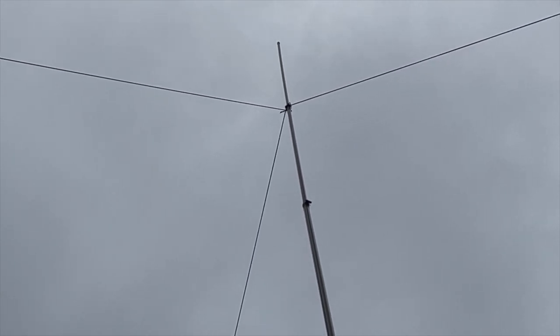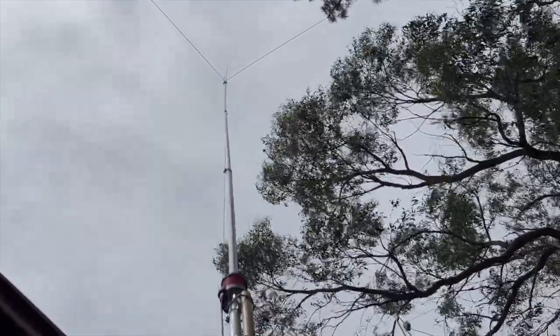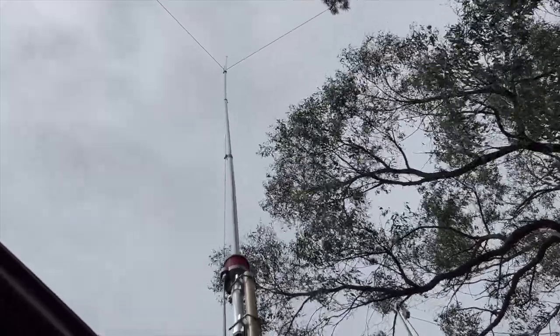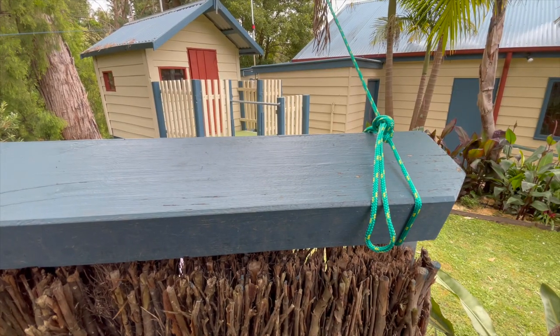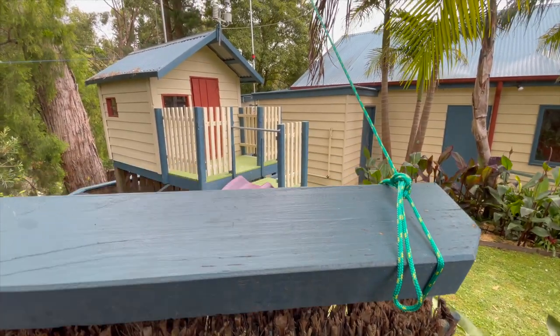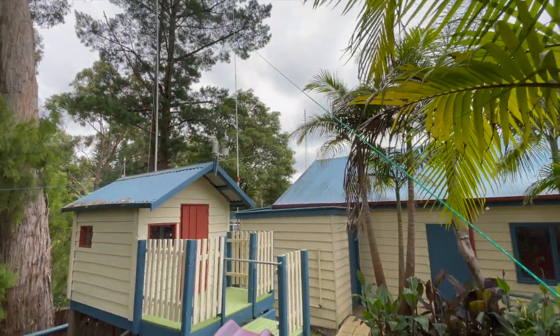You can see that the antenna is not whipping around despite the windy conditions — it's hardly moving at all. Since I filmed this we have had some very windy days with high winds recently and the antenna has hardly moved. All that has been required was some slight adjustment to each of the guy ropes, because over time they tended to stretch a tiny bit. There is no way that this Gain Master is going to snap in half, so the moral of the story is: if you choose not to follow Serio's advice and don't guy the antenna, then you can't complain about it if it breaks.